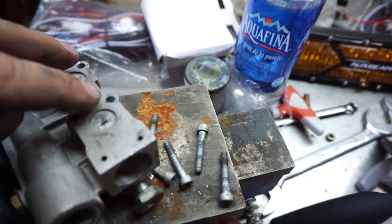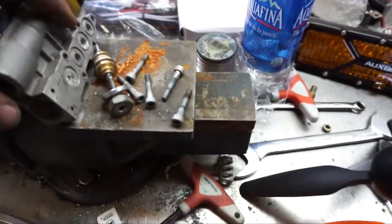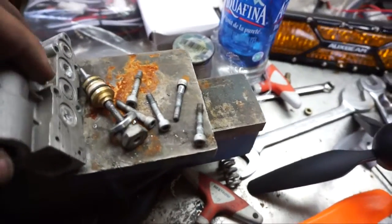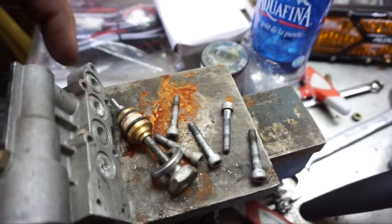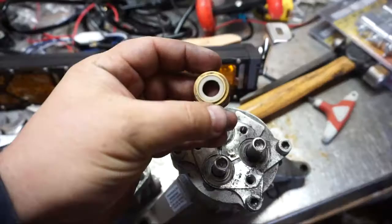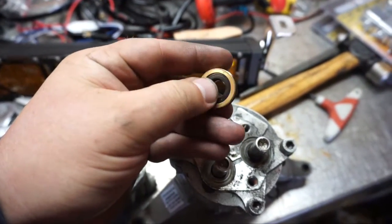Into these common ports here — there's a check ball right here and your pressure relief valve right here. What is pressure again? Force divided by the area, the area being what the water is in. This is your plunger seal and packing right here.